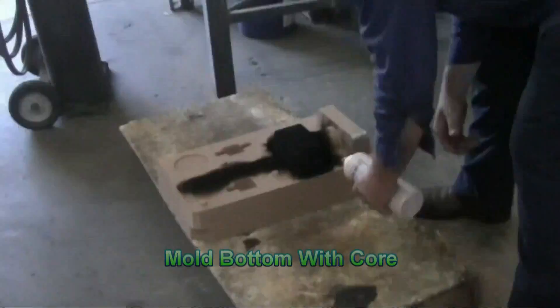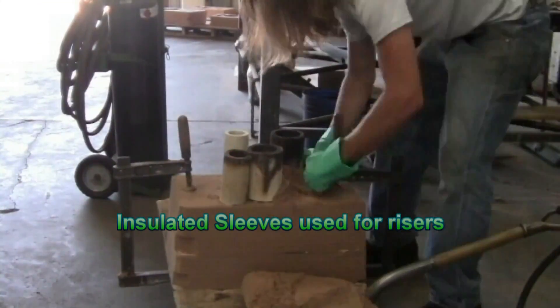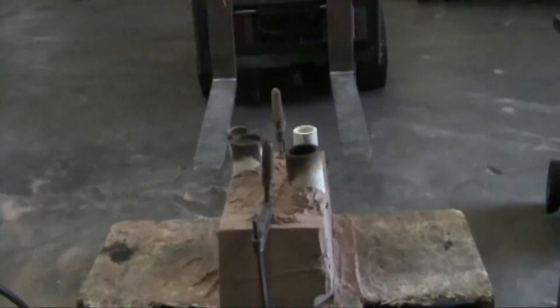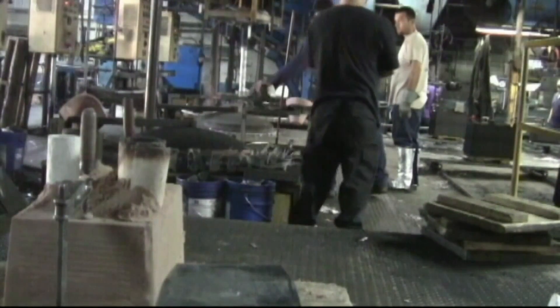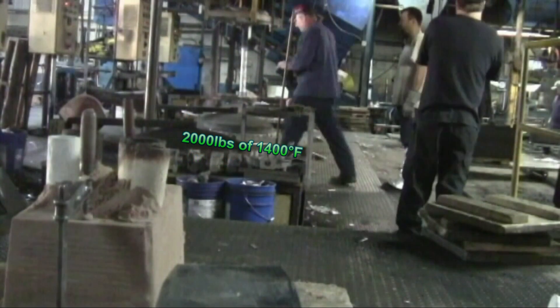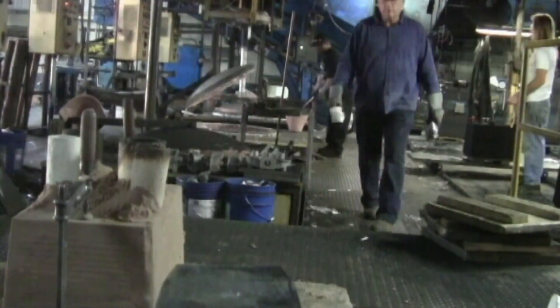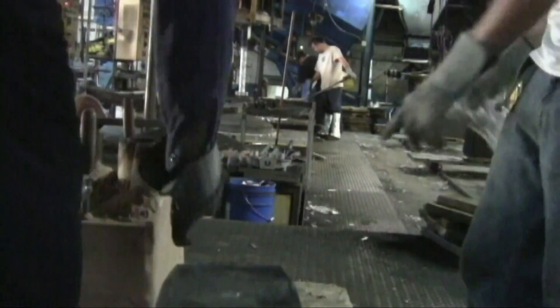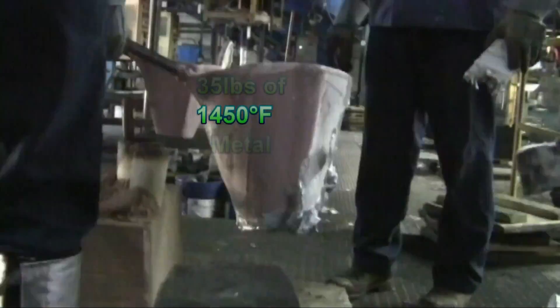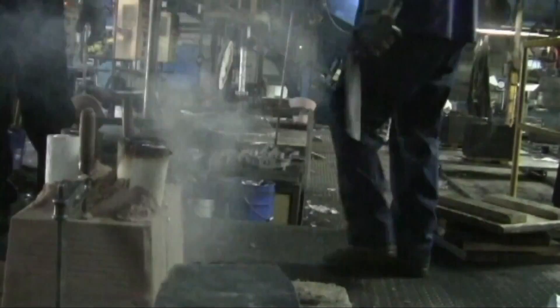The torch is being used to burn the chemicals in the sand, which adds a thin layer of carbon on the mold that makes the metal flow in a bit better and gives a much smoother finish on the casting. Now I just need to take the mold down to the pouring deck, pour the metal in it, and wait for it to cool. Don't try this at home — seriously, don't try this at home. Everyone you see in this video is a professional and has been doing this for a very long time. The metal being poured is 319, an aluminum alloy. It's not the strongest of the metals that we pour, but it'll be entering the mold at about 1450°F, and it'll take a few hours to cool because the air-set sand holds heat much longer than green sand.